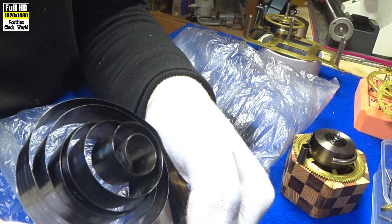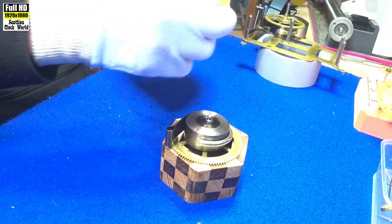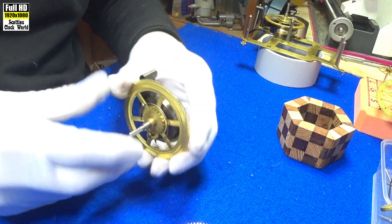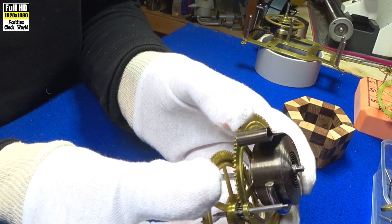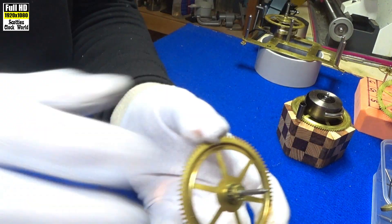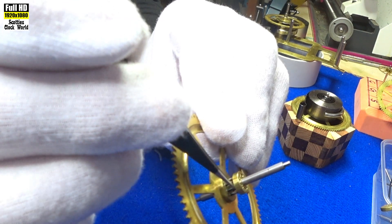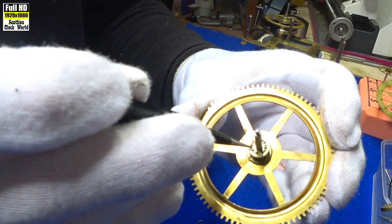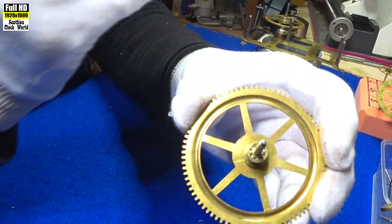At least there's no tears in this one at this stage. Because there's almost nothing more to say about the second wheel, we'll include it with the great wheel. That is the way they align in the clock movement. The power from the mainspring goes out through the teeth on the great wheel and into the lantern pinion. That's the lantern pinion there — it has little pieces of wire set in it called trundles. You can see where it's been drilled for the individual pieces of wire, and they're tapped down to hold them in place. You don't want them moving because it's under pressure from the mainspring.